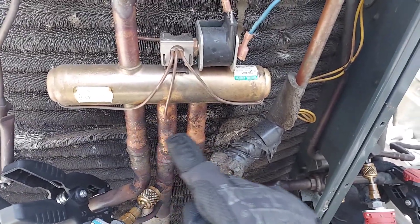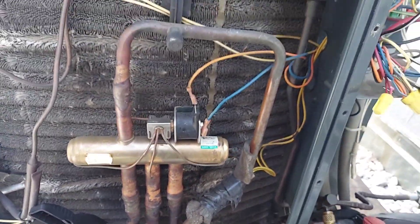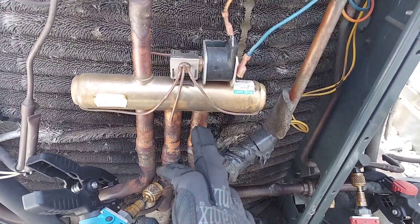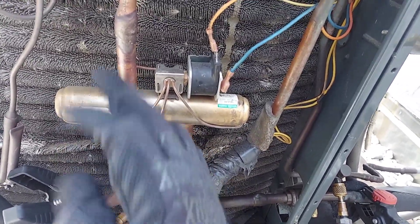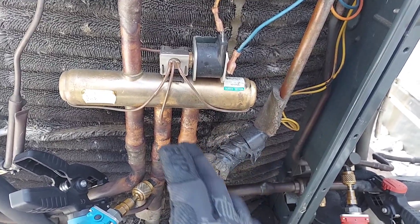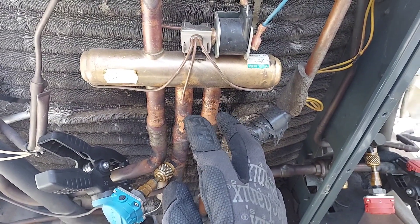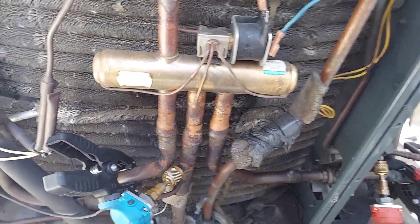So what you do — these pipes, these nipples attached to the valve, these three or four pieces, they're usually soft copper, similar to line sets. They're soft, you can bend them. If not, you can simply take your torch and make these three or four pipes cherry, glowing red. Once they're glowing red — and who cares if the valve is going to be cooking because it's an old valve and you're going to be replacing it — make it glowing red, and once it's cooled down, the pipe will be soft, and if it was already soft it's going to be even softer.